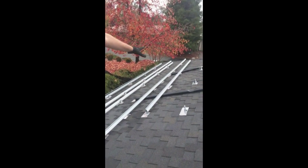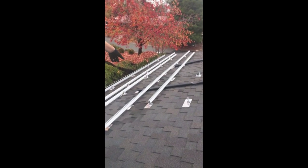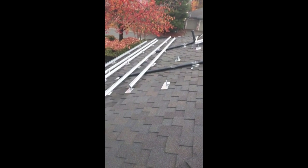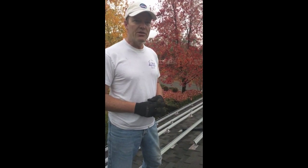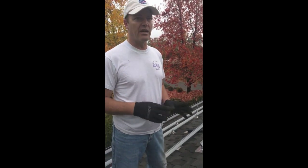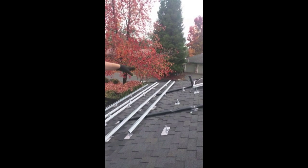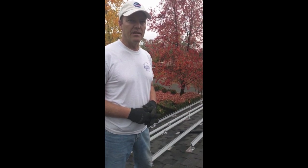This is how the roof jack will look when it's installed. We have two solar roof jacks here which are relocating jacks that would have gone straight up 12 inches, putting them underneath the rails. Solar Roof Jack recommends driving the output all the way to the closest edge of the solar panel, but another consideration was that we get a lot of leaves and trees on the side of the house. By going straight up, I leave less area of pipe across the roof that would block the leaves.